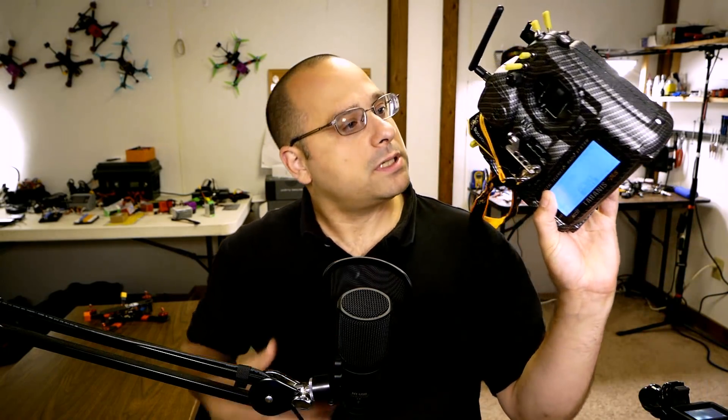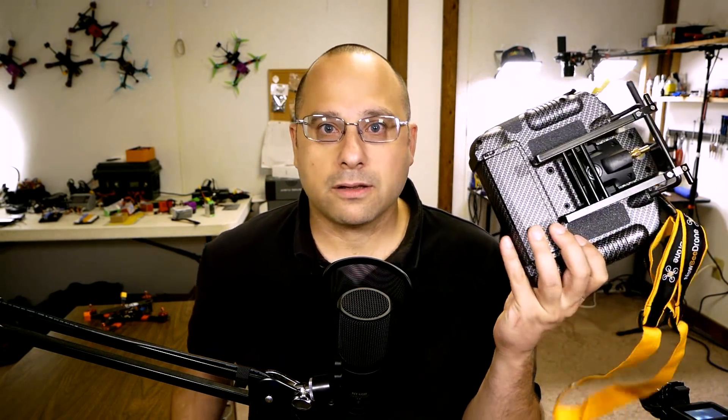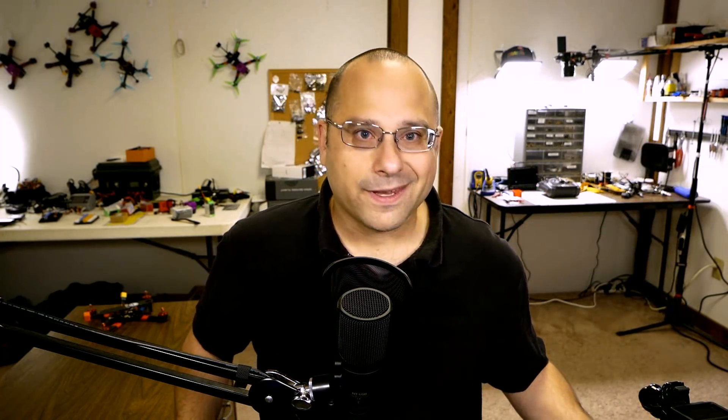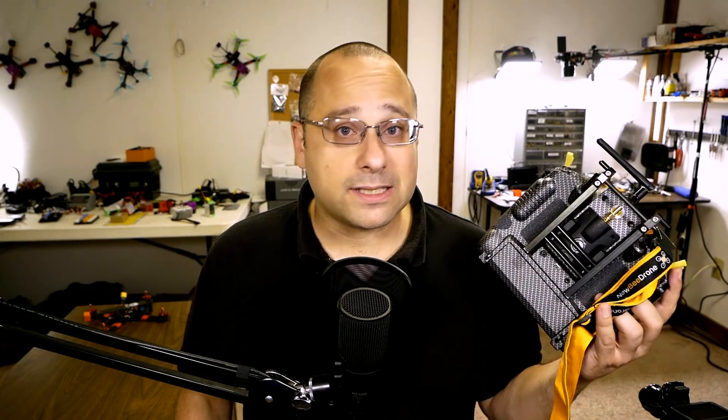If you set up arming on a switch, that's great. Arming on a switch — stick arming, who does that? We shouldn't do that anymore. Stick arming was an artifact of a time when we had four-channel transmitters and they were like, how in the heck are we going to arm and disarm a quadcopter? With a plane, we just raise the throttle — as soon as you plug in the battery, the plane's ready to go. And they were like, we'll just hold the stick down and to the left or to the right and that'll be our arming. But we don't do that anymore. We can just use one of our many, many channels. Most radios, even the cheapest ones, have at least six channels, and many of them go eight, 16, even more channels. We just flip a switch and we arm and disarm.